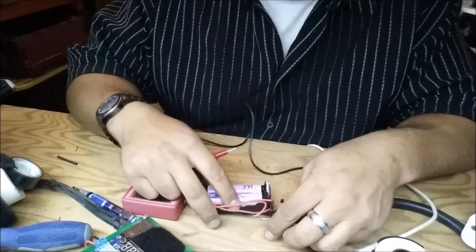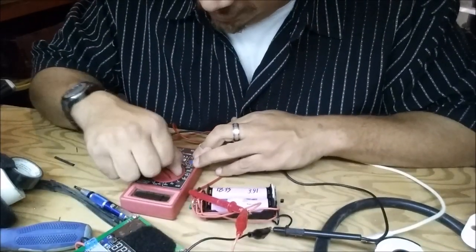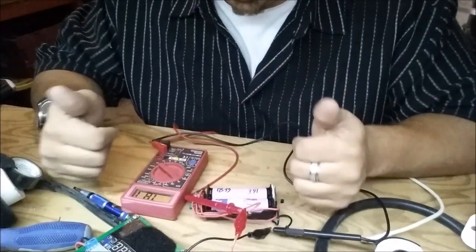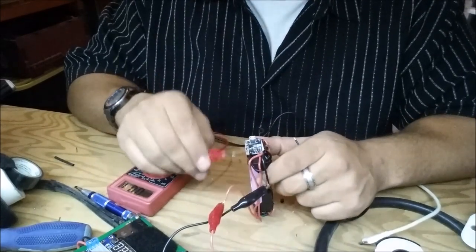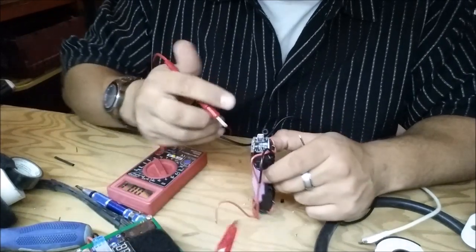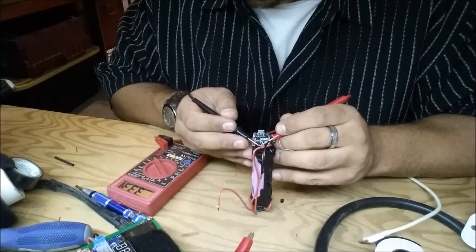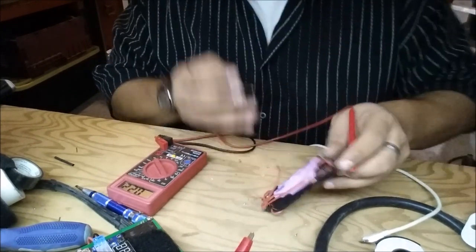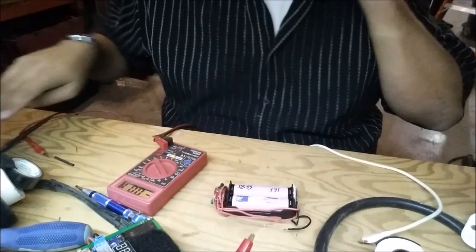Right now it should be in the off position. Just using the leads off of this right here to clamp them together basically. Okay, so when we go on, 7.8. That's good. They're kind of dead, but that's good. When we're off, this right here should only be getting 4 volts or less, I guess, if these were fully charged. Yeah, 3.9. Huh. So that should be 3.9. This should be negative 3.9-ish. Okay.